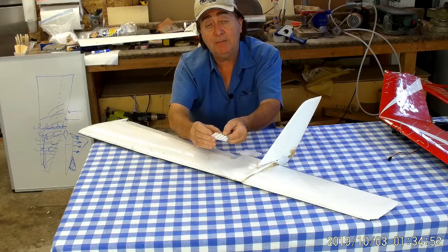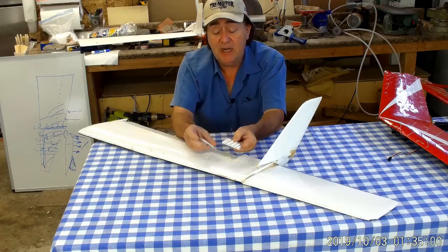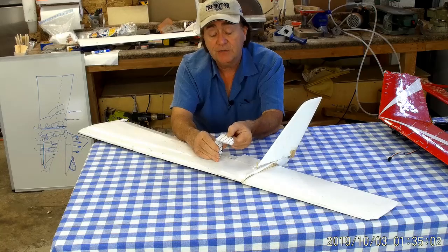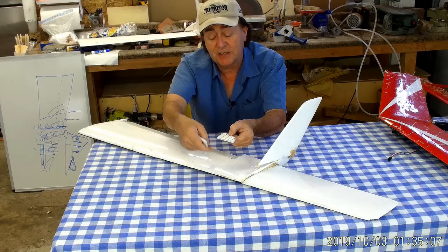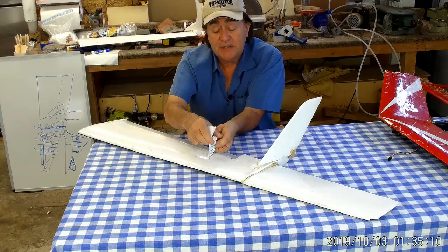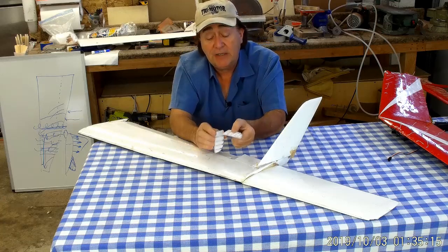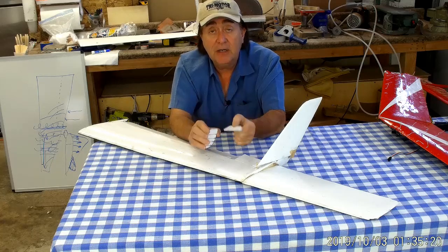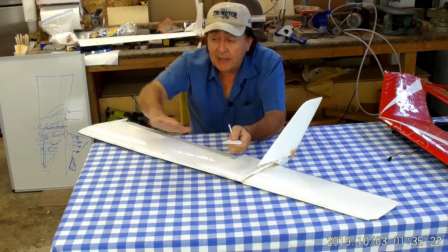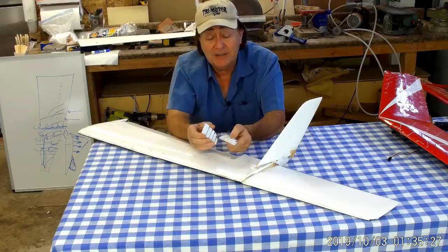And by the time you get up to the top, if the fillet's the right size, if it's made large enough, by the time you get up to the top of the fillet, this boundary layer is now out of interference with that boundary layer. In this greatly exaggerated example, the fillet would have to be about this large. It would have to go from here and curve up. But this boundary layer can be on that fillet all the way around, and you don't have any interference drag. That's why fillets work. That's why we fillet in aerodynamic surfaces, and you get that nice smooth shape, and it looks nice to everybody. Well, it looks nice because you're preventing that interference drag.